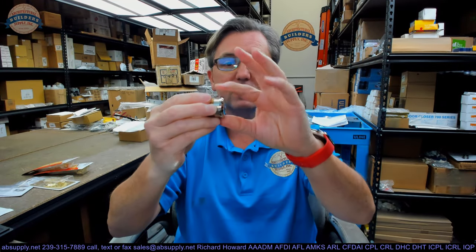If you can get to the head of the cylinder, you have potentially a way to bypass the lock. If you were to destroy and damage the cylinder to the point where you peeled it off the door, you would have access to a compromised area inside of the lock. With a small amount of special knowledge, you might be able to bypass the lock. This plate restricts access to the head of that cylinder — that is the weak point. You can manipulate cylinders through means of destructive bypass.